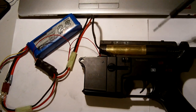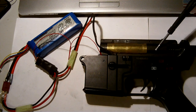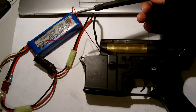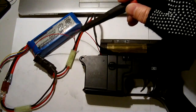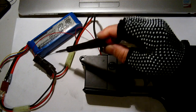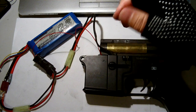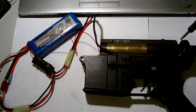I have reassembled the gearbox back together. Right now the signal wire that comes from the trigger switch is wired to the front of the King Kong, and the King Kong is connected to the motor through the original AEG to battery connection. The battery, which is an 11.1 volt LiPo battery, is being connected to the burst with the King Kong.